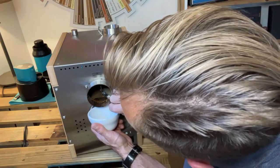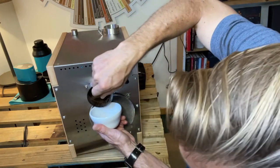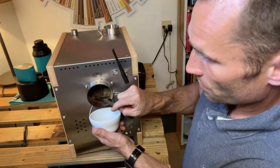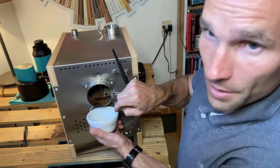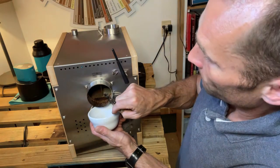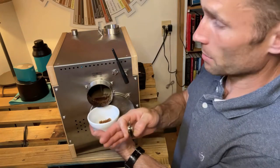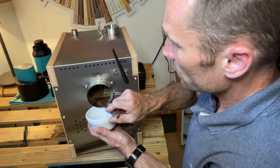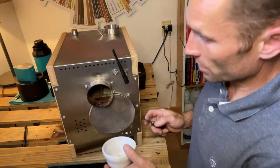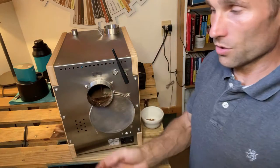I won't do all of this right now because I want to spend a lot of time getting in there. You can scrape the inside wall. Back here, you can see this chamber is much darker — this is the roast exhaust. Then this chamber is much lighter, with some white powdery material, which I'm guessing is the cooling tray exhaust. So both the cooling tray exhaust and the roaster heat exhaust collect together and blow out of my exhaust pipe. The air blows out this direction, so I'm safe to vacuum out that direction.